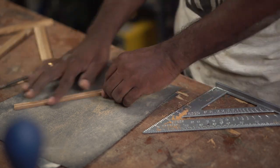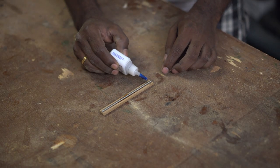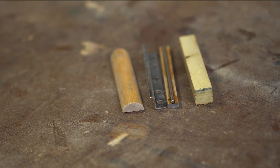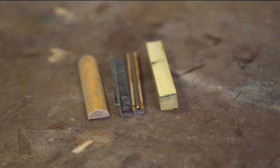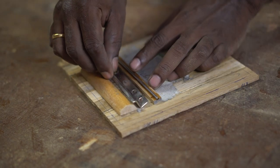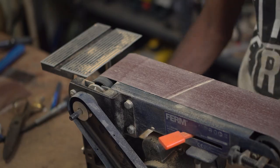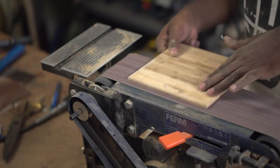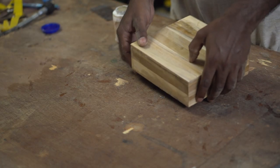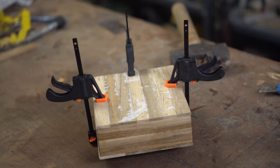The wood piece on which the metal rod sits needs to have a groove. This can be made using wood carving rotary drill bits. I made it slightly longer as it was easier to work with, then cut it to size. Although this can be done using a file, a Dremel works faster. The iron rod is placed in the groove and a drop of super glue is good enough to keep it in place. These four pieces get fixed on the top plate — these three pieces are set on top in the order shown, and placement of the distance between them depends on the length of the tines. Before fixing everything, the top part was sanded for a smooth finish.